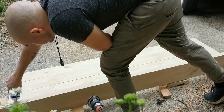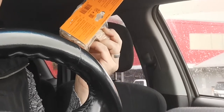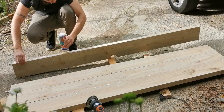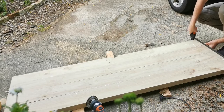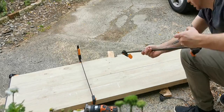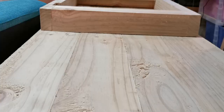Now we get to the gluing of the main tabletop, which I really regret how it went down. I had planned to use biscuit joiners, but on the day my drill and router died. So I ended up just gluing it with PVA glue and clamping it together and hoping for the best. Unfortunately there was a little bit of warping because there was no dowel keeping things straight — the whole tabletop ended up with a slight curve. I tried to remedy this by screwing some strips of wood to the bottom, which also act as guides for the legs to rest against.